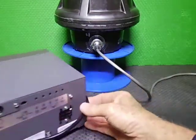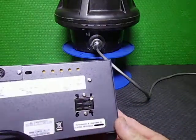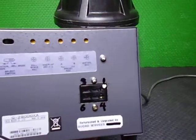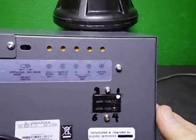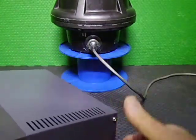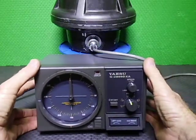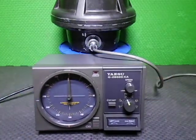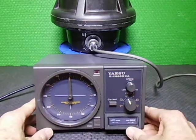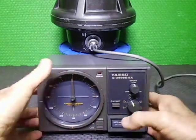On the back, since we didn't want to change the plug to the bodge Molex-style plug on the later version, I've put in the original Jones plug on the back. The rotator itself was refurbished, had its potentiometers replaced, and we had to physically realign all the limit switches to match this controller.